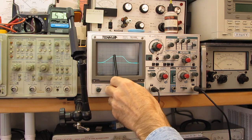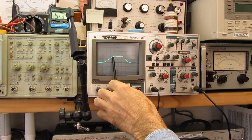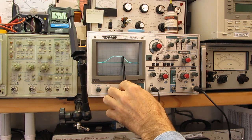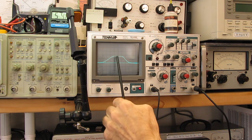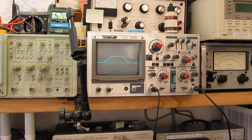When you start getting out here outside of the bandpass, it's not very important. What's important is the area between minus 75 and plus 75 kilohertz in relationship to our 10.7 IF center frequency. Our deviation of signal, our frequency, is going to happen in this area, and we want that response to be as flat as possible.